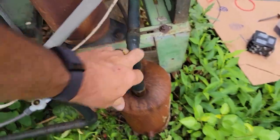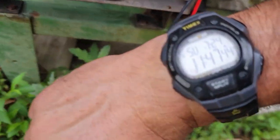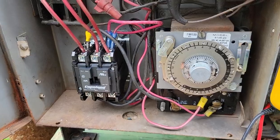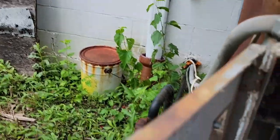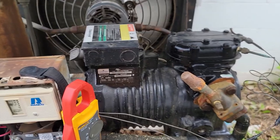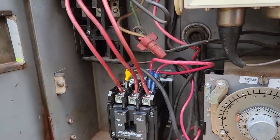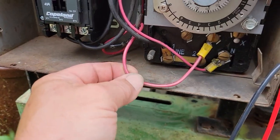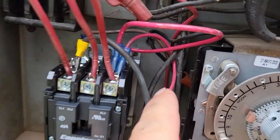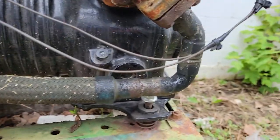We've got some good old-fashioned accumulator action working there. The clock doesn't look too far off. Got a one-hour defrost timed off. It does not look like there's a solenoid — this thing just shuts off and goes pop. That brown wire going into the coil comes down, and the four-wire is your normally closed circuit. When it goes to defrost, it opens and breaks power to four, which kills the contactor and she kicks off. So there's no pump down on this thing at all.